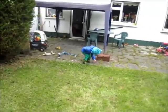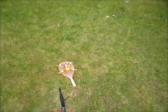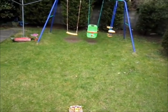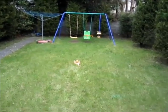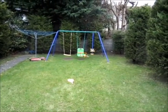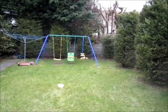Why did they go outside? Because I have to test my new copter. Right, so I got Betaflight 2.4.1, dropped the P's to roughly 4.0, cranked up the rates to 0.5-ish, just a little rough tuning, just put on the level, see if it has enough power on 4-inch props. Yeah, P slightly too high. I will get it tuned.